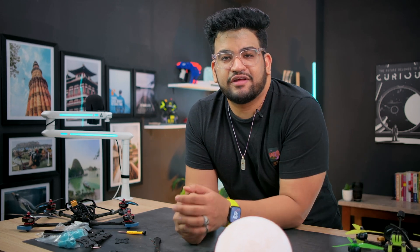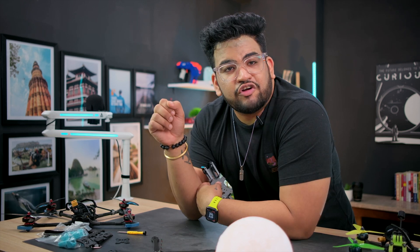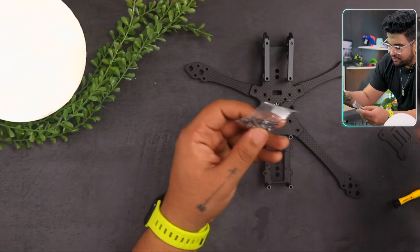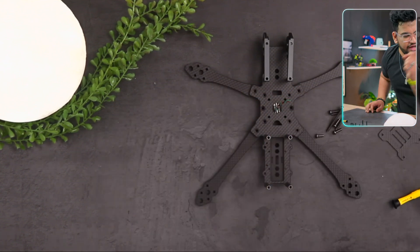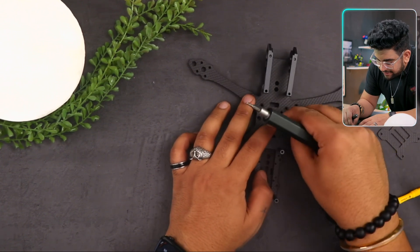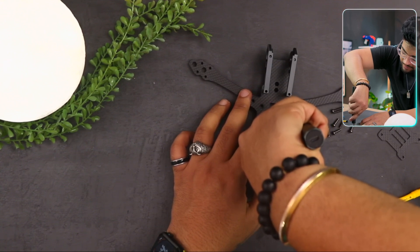In a dead cat frame the propellers don't come into the picture, so if you want to enjoy the scenery while flying FPV, dead cat gives a better experience. You can also use your O3 camera for recording, which is what I'm planning with this build. For the next step, place your main fuselage or middle plate on top of the arms and screw it down. Four of the screws also serve as the stack screws and the rest just hold the arms. You can also put screws going from top to bottom — that makes a great sandwich and the frame becomes really durable in any crash.